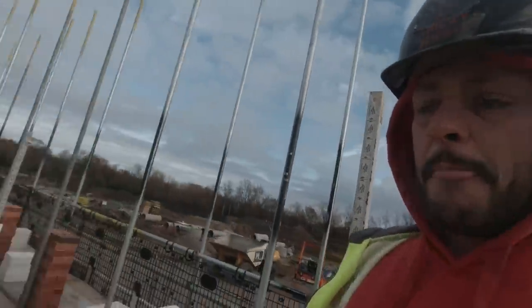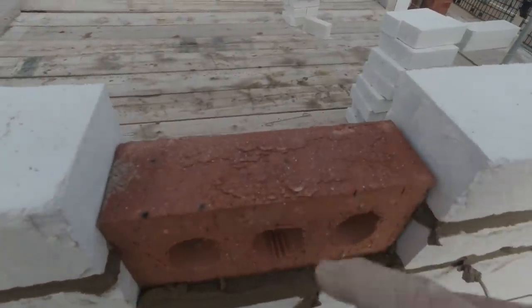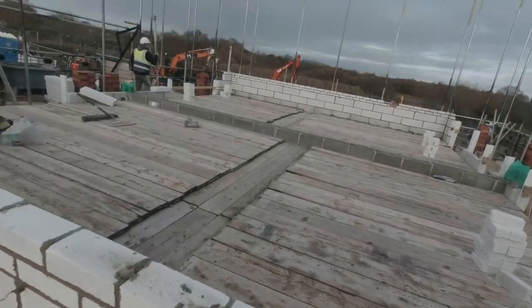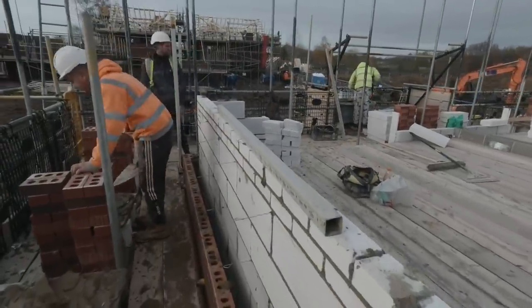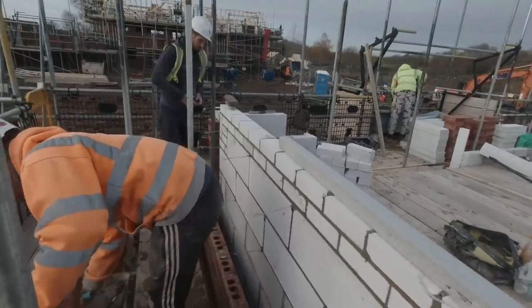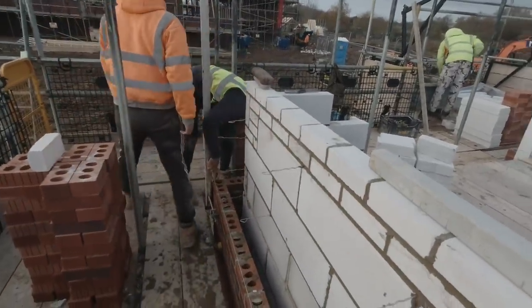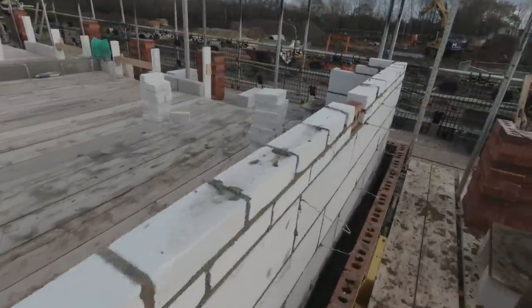Lovely. And then this time I've got the air vent coming here. So I've left a little brick there to put a 4-inch through, and then we'll build it in, make it all nice and hard around the outside. Tommy's got his profile up, Timmy's got his one up. Lovely. Have you measured off your frame, bro? Level across from your frame. See where you've got to go. Tom's there, Dave's doing his. We're nearly there. Lovely.